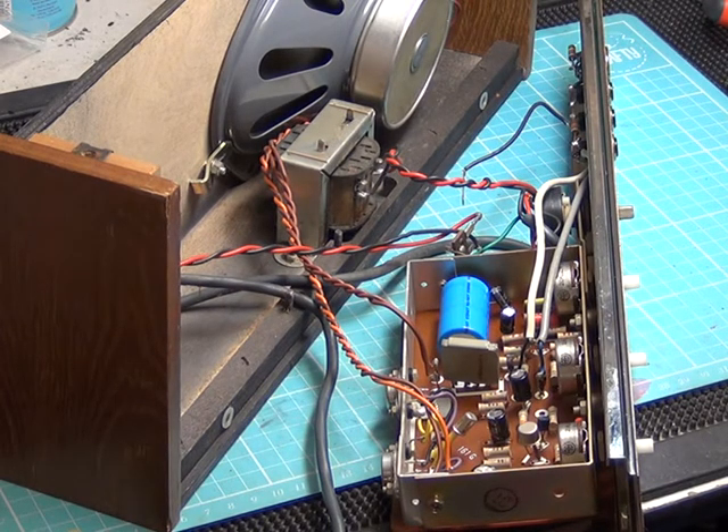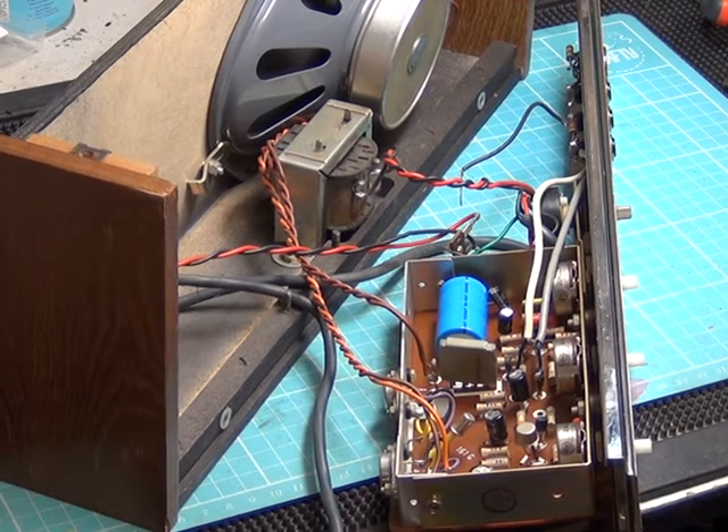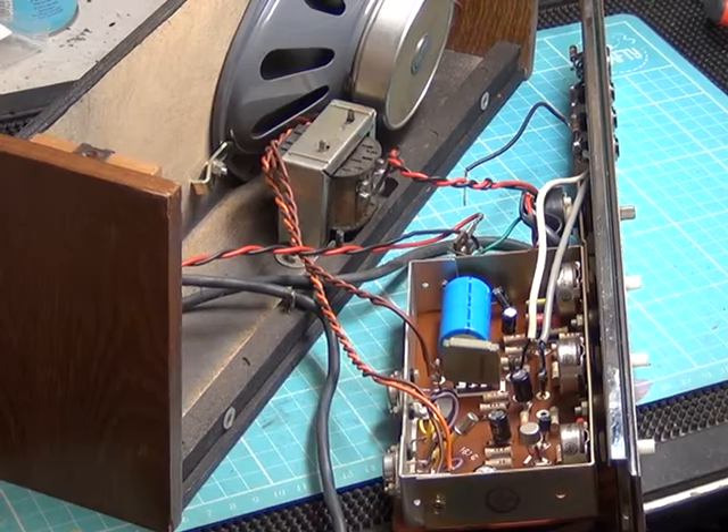Right, we're going to test this, and then when we've put it back together we'll put it on tape if it actually works. Let's hope that the AD162/AD161 complementary output pair don't fail like they did on the ultra record player with the same module — that lasted for two and a half minutes until we had to change that pair of transistors. So with that, I will talk to you again when we've put it together.